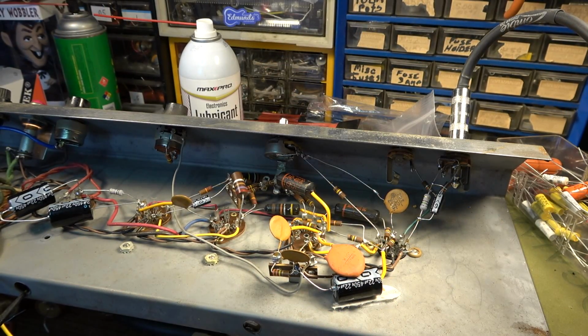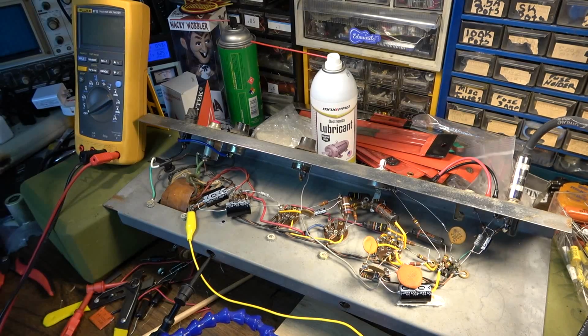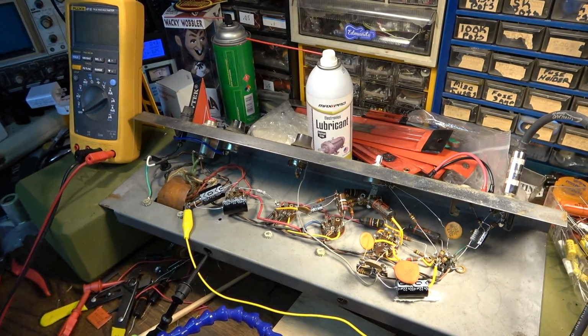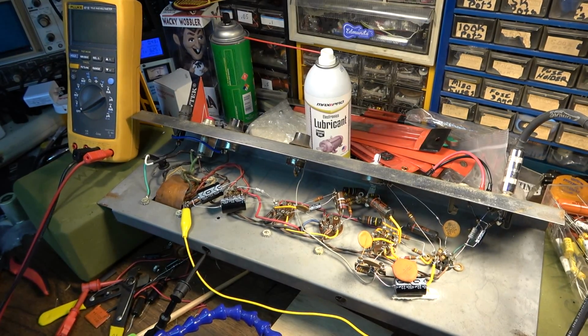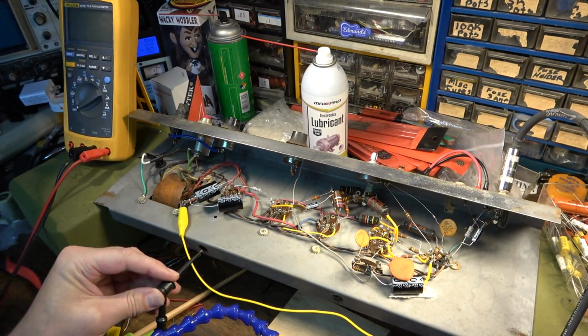They were trying to keep it clean for the Gibson guitars, which had, of course, humbucking pickups. The thing everybody knows about humbuckers is they have a higher output, and if they're trying to keep it clean with the humbuckers, you're really robbing a lot of tone. You have to take out a lot of frequencies in order to keep those clean most of the way up the dial. A coupling capacitor's main job is to block the high voltage DC that is on the plate of the previous stage, so that you can safely couple to the next stage.